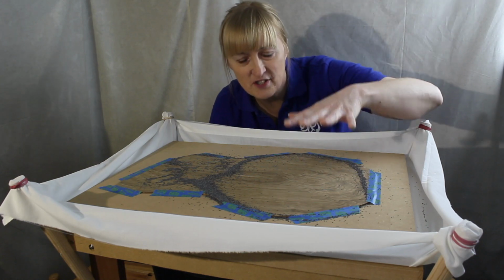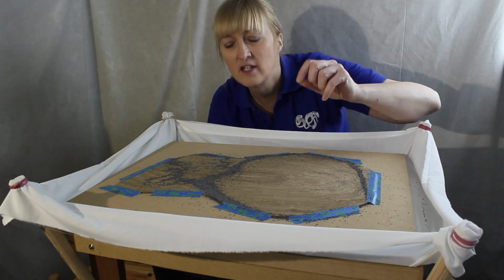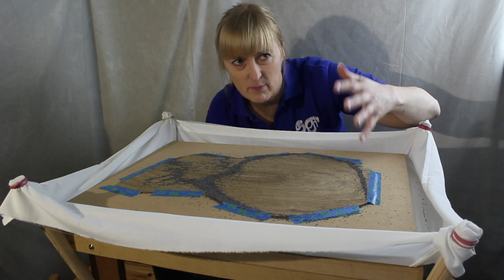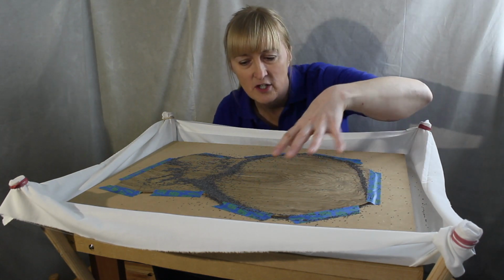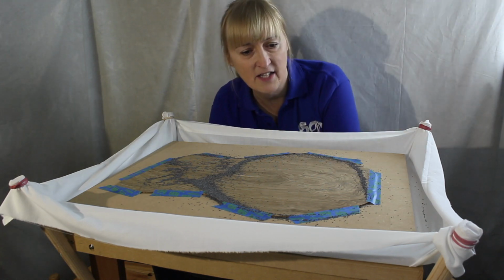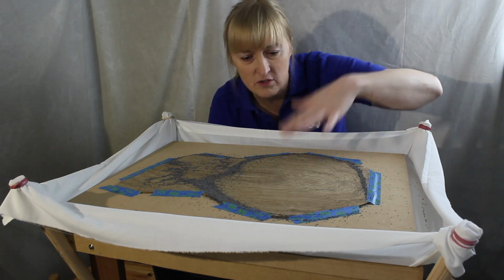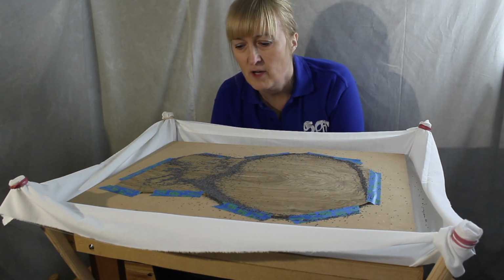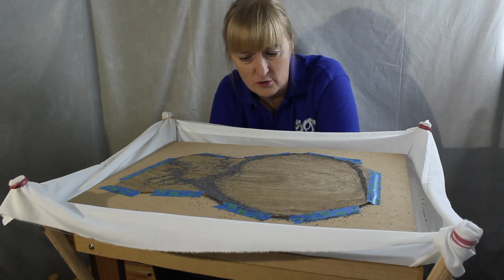This information is not useful for this build as such, because this is unbraced, but knowing that this displays a monopole at 89 Hertz, let's call it, is useful information for later builds, because I can compare it to other backs that I might build, which may have higher or lower frequencies. If this guitar seems to work well, then if it's a higher frequency, we could perhaps thin the back out to lower it before we put braces on. I don't know whether that's the sort of thing I will do, but it's information that's useful to store away for future use.